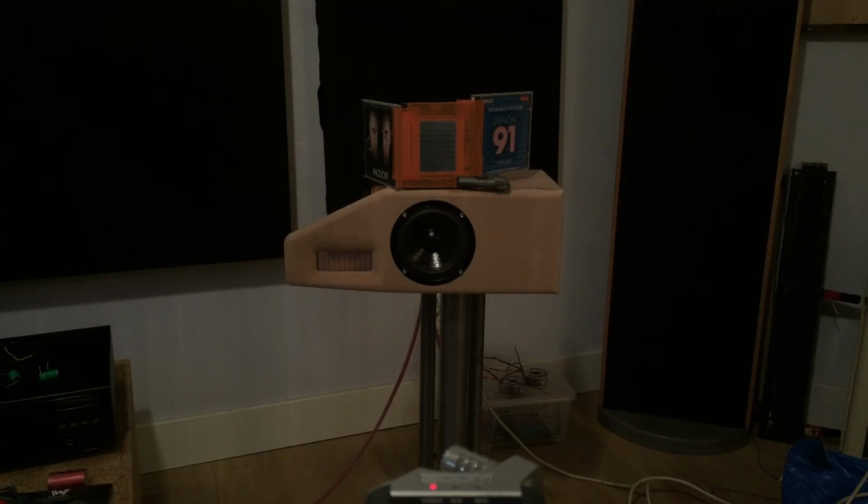But I'm not sure. Of course, the high frequency dispersion is completely bad with this huge panel. But I still have 4 dB left on output, so I could tape off some stuff and dispersion would be better. But I think it's better to use it as maybe a mid-range. Still, I actually need heavier foil with heavier aluminum. But I don't have it at this moment, because I have to buy 50 meters. And well, I don't have the money.